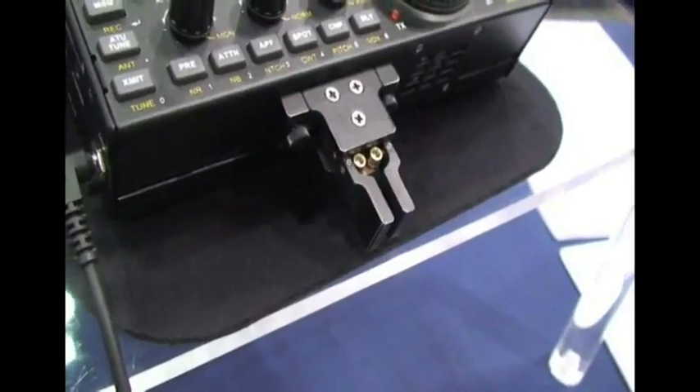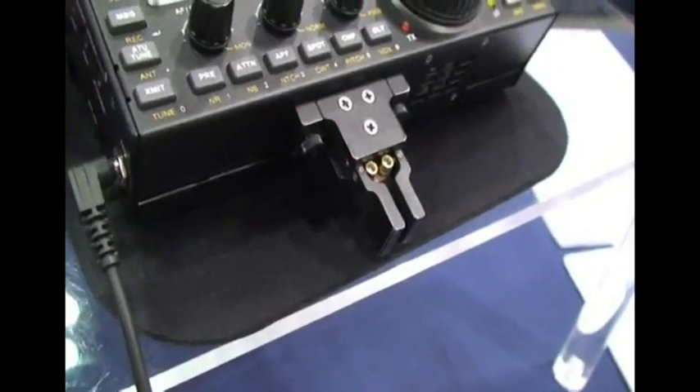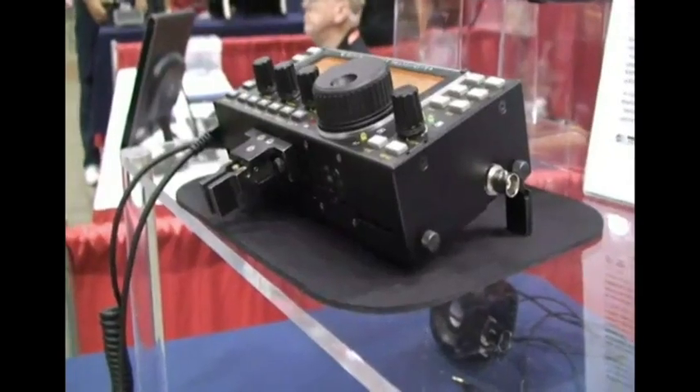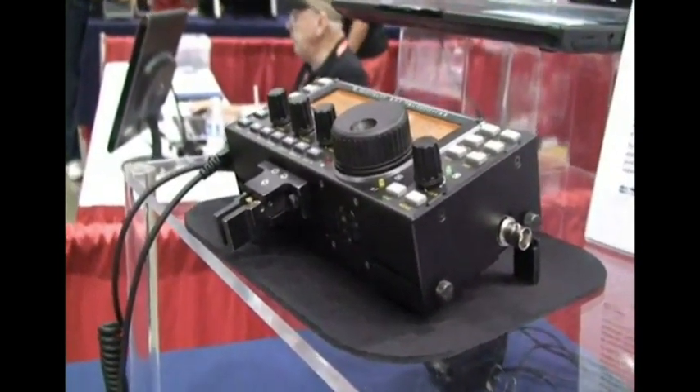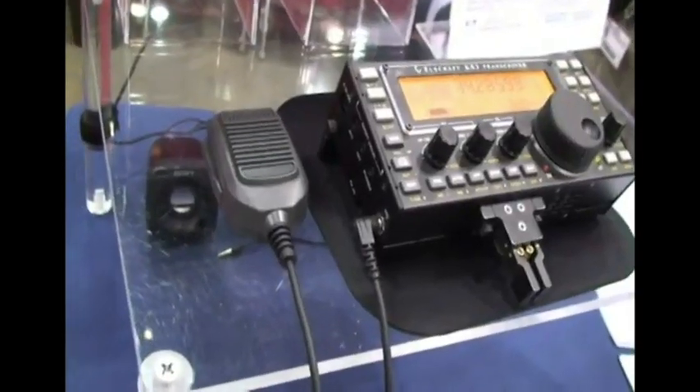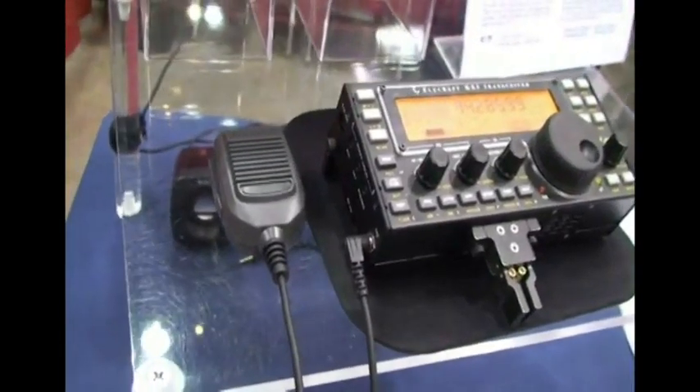Right now, you can send with your paddle in CW mode and it'll convert it to RTTY or PSK31. It's more for fun, but it basically lets you casually tune around and listen to stuff. It also has a computer interface, so you can do all those modes directly through a computer terminal too.